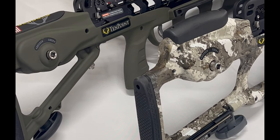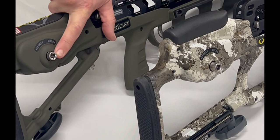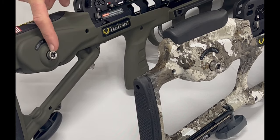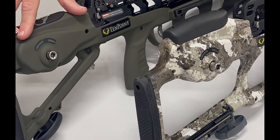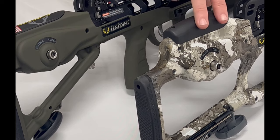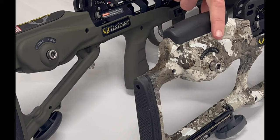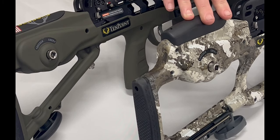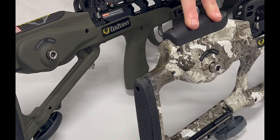The two different brake systems on the AccuSlide are fairly easy to identify. The older model has a short collar on the chrome knob where you install the crank handle, with a fair amount of knurls all the way around it to make it easy to grab when adjusting the brake. The new style has a much longer collar and doesn't have as many knurls. The only reason you need to know which one you have is how many turns you back crank the unit after it's been cocked.